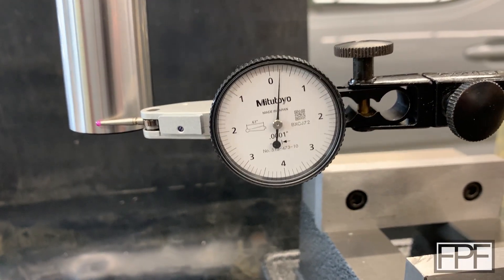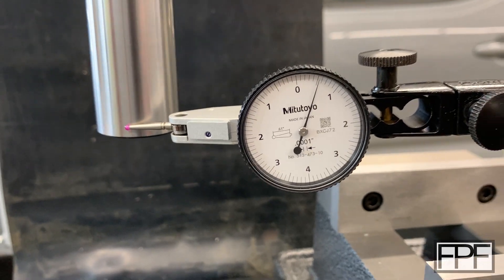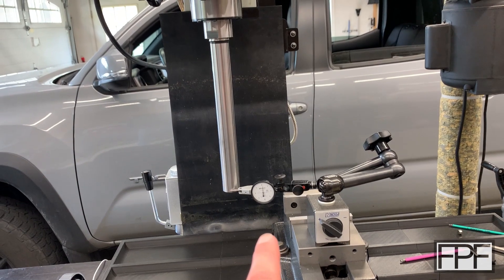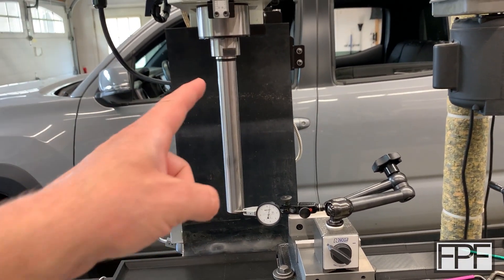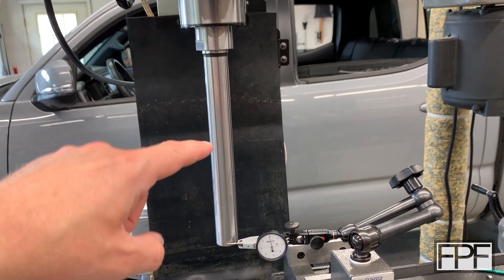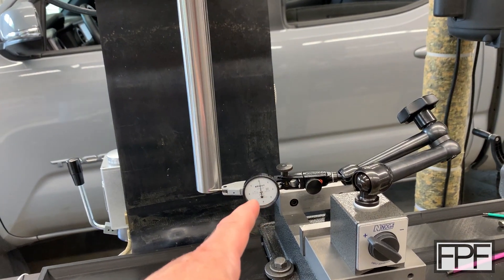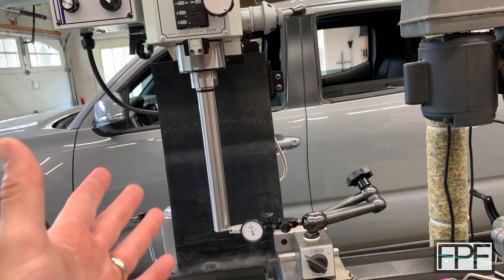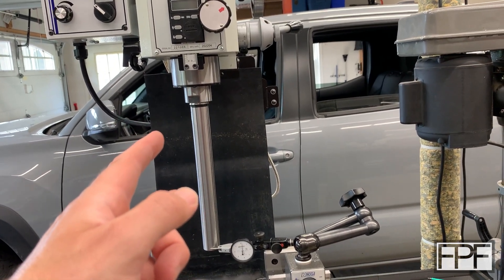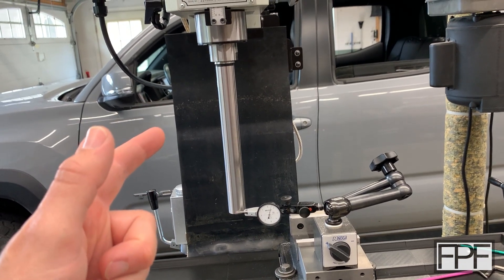We're really reading between the lines here, and it looks like it varies — maybe on one rotation of the bearings it's closer to five, and another rotation closer to five and a half, which isn't unusual. It's so good. I'm going to reseat this, pull it out, reseat it, and read it again to see if it makes any difference, because at this point a piece of dust could be trapped and change the measurement. I think the spec on this machine, as Matt from Quality Machine Tools defined it around five inches, was up to 1.2 thou — that's 12 tenths. We're reading five tenths down here, so we're obviously well within spec. In fact, way beyond spec. I would not expect this level of accuracy from a machine at this price point.